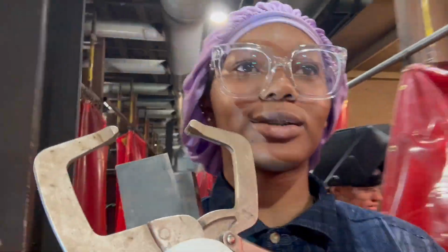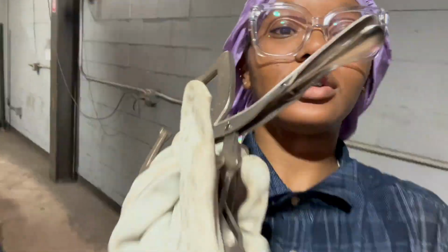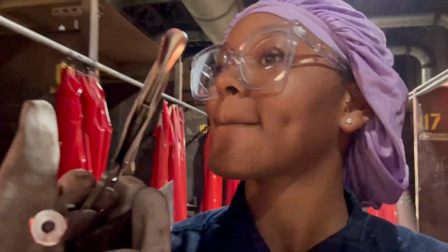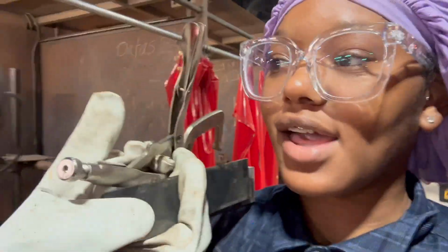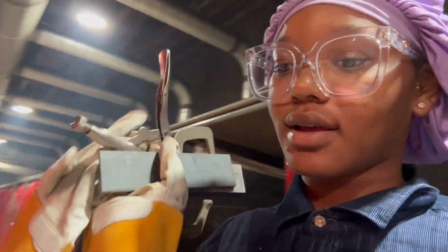Alright, y'all. So basically, he said that I was doing a pretty decent job. All I gotta do is push. He said I'm long arcing, which means when the instructor says you're long arcing, you pull it too far away instead of pushing in. And then he said that I need to work on my grinding, but it's not so bad. So that's a good thing. Day one, we're getting it done. We're gonna try to do it again. And y'all know the prep takes the longest. So that's what we're gonna get into.